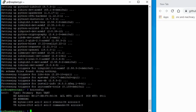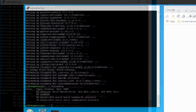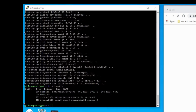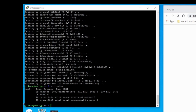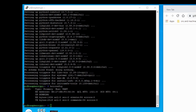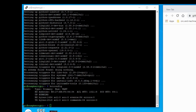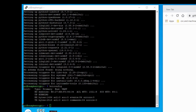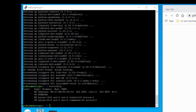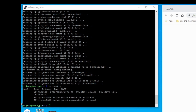So now we need to start loading in the software. Now, to write all this software into the actual Pi, we need to create a directory system first, so it matches up how Brian has it set up, and then when we run later on a service file that loads the program up automatically on reboot, it'll all work.